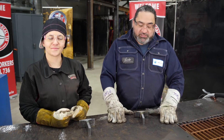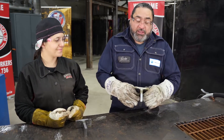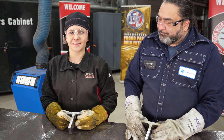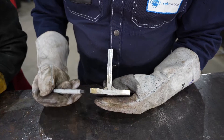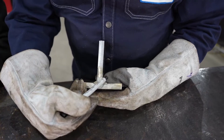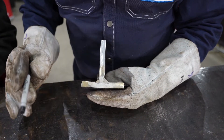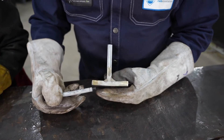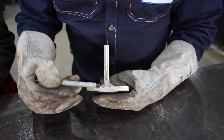We finished cutting the plates and we etched them. When we started, we were wondering what were the benefits and disadvantages of pushing and pulling. I pushed mine and you can see I got some nice clean welds, nice flat top surfaces, but very limited penetration. Looking at the side cut of my weld after we etched it — I've marked it out with marker so it's more clear to see — tops of my welds are nice and flat, making for a nice smooth pretty weld, but the penetration is quite limited. There is enough penetration though — this is a good weld, it will pass and be good enough for most things.